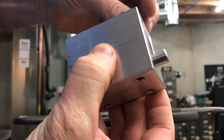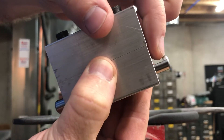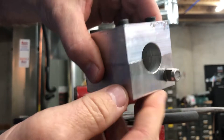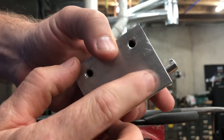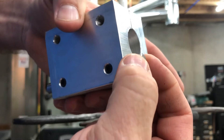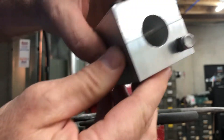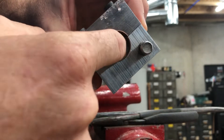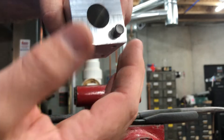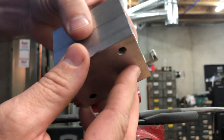The dowel pins have notches in them for the legs of the spring to set in on both sides, and those are adjustable. You can loosen the set screw and spin them — what that does is if you're having a problem getting the main pin to go through the spring and through the trap frame, you can adjust those to make the spring legs kick out more to allow more clearance to get it in the frame.